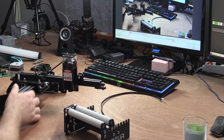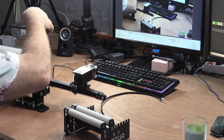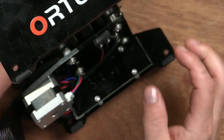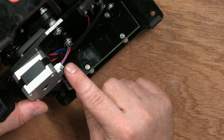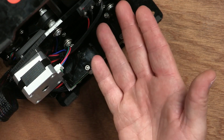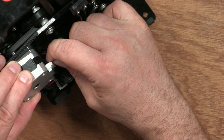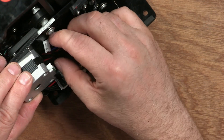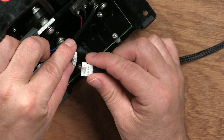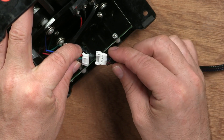Here we have the machine, and the stepper that controls this motion is this stepper right here. When we rotate the unit to the bottom view, you can see the plug that we have to unplug, because this motor is the one that sends the whole machine from left to right — this is called the Y-axis. So what we are going to do is unplug this plug and extend it with the plug from the rotary roller, and there is only one way to do this correctly.